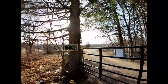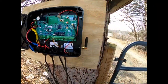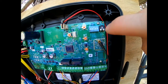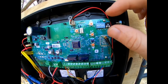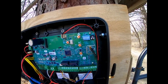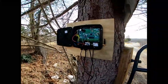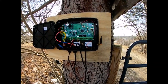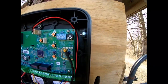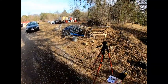It makes that beeping noise and then it closes automatically. To set how long it stays open, all you're gonna do is adjust this knob up here - all the way around is your max, and you turn it to get to where you want it for like 30 seconds, one minute, two minutes. It's those five wires and you adjust your knob. I already had mine buried in the ground so I was able to reuse it, which is good because they're $130 plus.